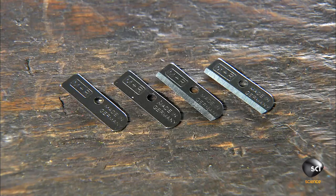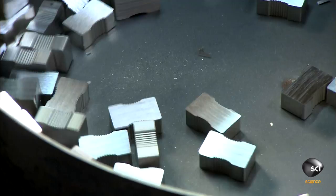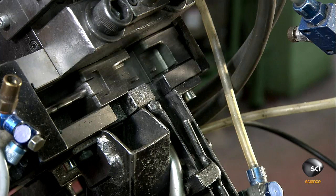Next, they manufacture the housing for the pencil sharpener blades. A circular saw cuts a ridged magnesium bar to the correct length. The magnesium blocks tumble into a feeder, which funnels them into a stamping machine. Machinery then moves the pencil sharpener bodies forward to a drill that bores cone-shaped, pencil-sized holes into them.